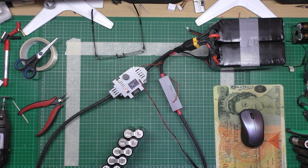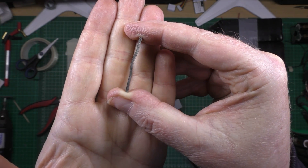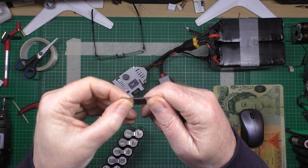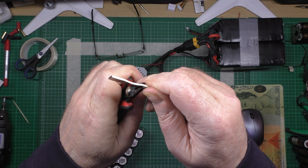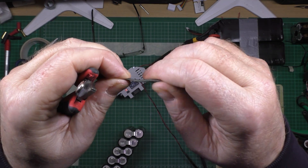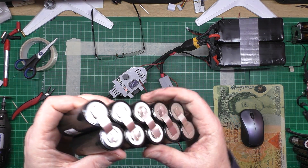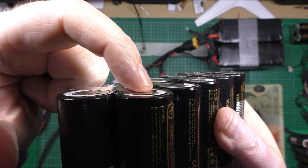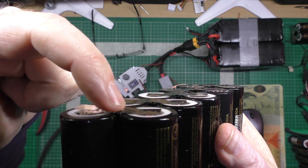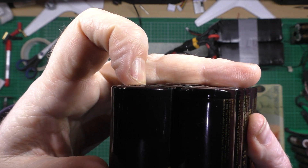My back is agony. This is what I've done with the new build - I'll cut these to size and then with some pliers I've bent it round a bit and put a lip in it. The reason I've done that is I was concerned because I've got to put all the parallel and series connections - I was worried about bridging. That's the positive and the negative is the outer ring, so I was concerned that when soldering it's going to touch because of the heat. Well, that lip will prevent it from touching, in theory.